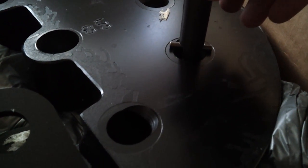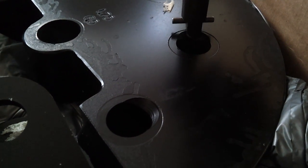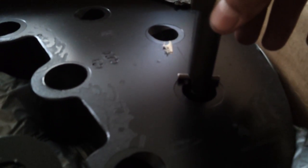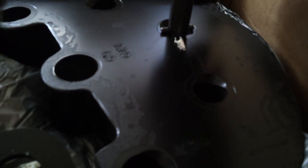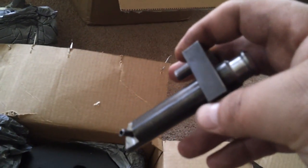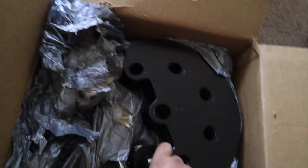When you're bending the tube, it's going to slide up the angle, slide across here, and then drop. When it drops in there, it's going to prevent that die from springing back on you. I believe they call this an anti-springback pin. If I'm wrong, I don't care — that's basically what it's doing, and that is exactly what it's doing.